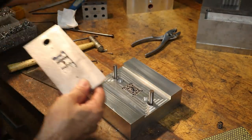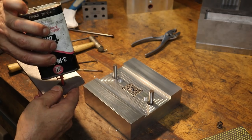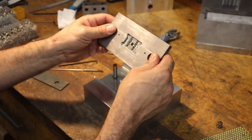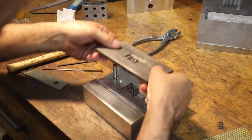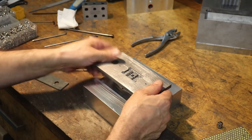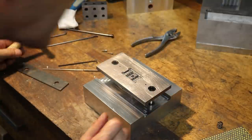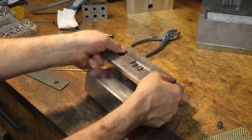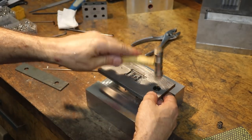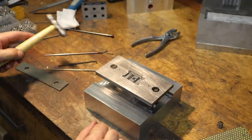Okay, so now we're gonna slide. I think I'm gonna oil these bearings a little bit. These hard anodized bearings do generally want some lubrication. So we're just gonna do a test fit, double checking alignment of the features. And let's see if we can convince it. Huh, I wonder why there's a step. That's weird. Seems like this side is higher. Yeah, doesn't seem too happy.